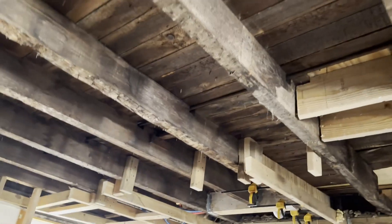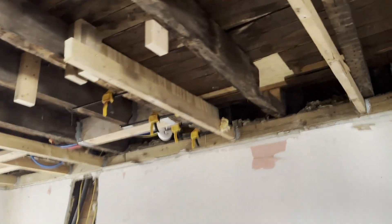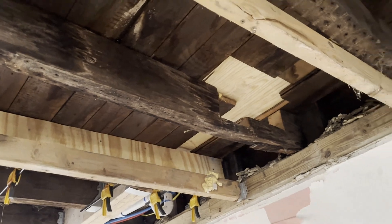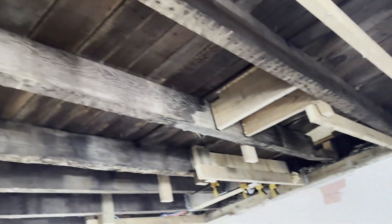There are other things I'm going to do to stiffen the floor because it is kind of bouncy — I'm going to install blocking, but I'll probably do that in a different video. For this fix, I'm going to use two sheets of plywood on both sides. It's basically going to run from here to there, and it's going to cover almost half the length of the beam.